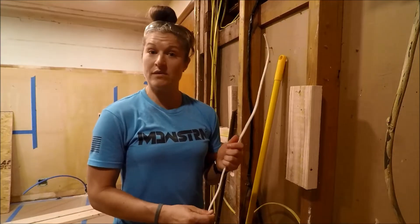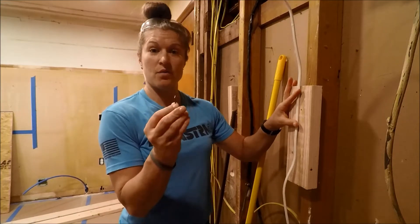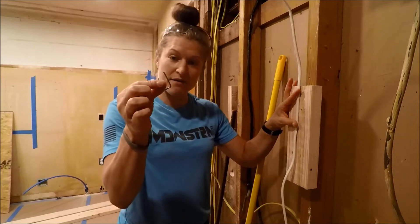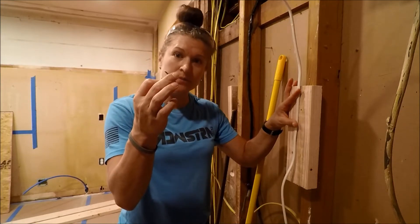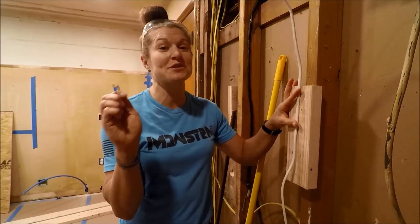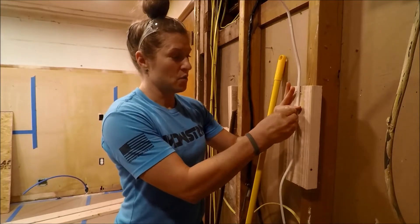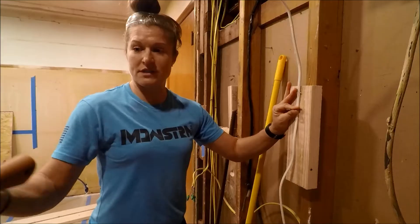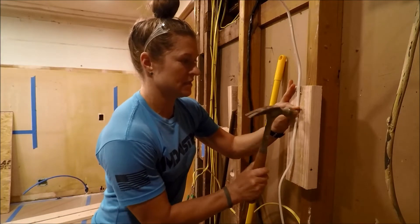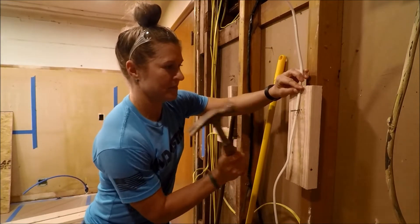First we will demo the way you should secure your wire with your staple. I'll also note that we have staples that don't have any little flanges, but now we know for future we will be purchasing some of those because they help you know exactly where to stop driving your staple in. So we'll put our staple here, take our trusty hammer, drive that in until it gets somewhat secure, and then I can move my hand for the rest of the staple.